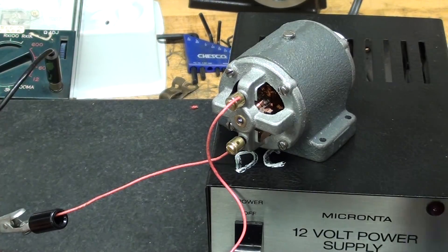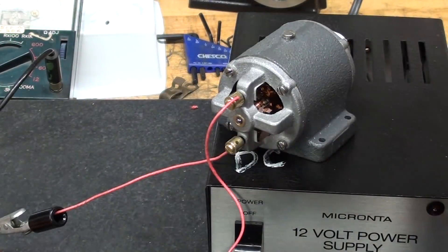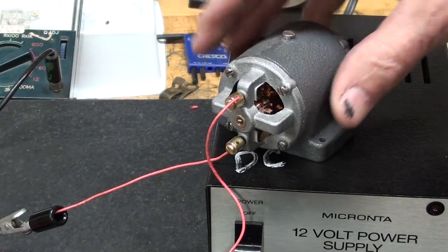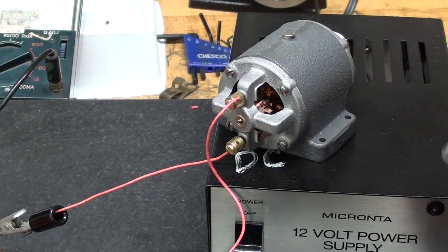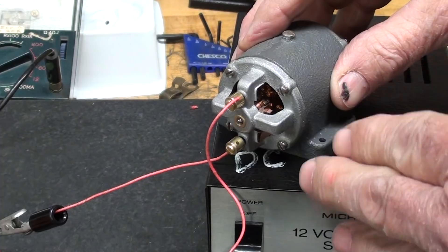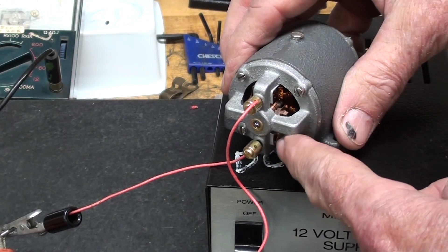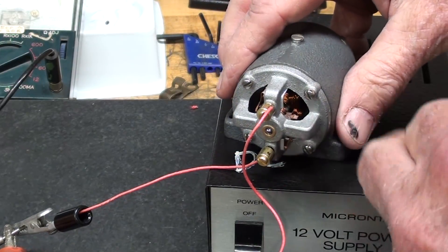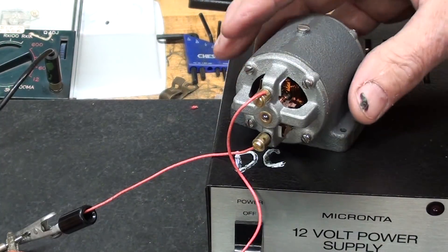Those of you that are observant may have noticed that he changed the orientation here — now the binding posts are in the vertical position. Well, I plugged the thing in, and it didn't produce much voltage, perhaps two volts. And I thought, what's wrong? And then I read through the directions again, and of all things, it said to assemble this with the brush holders in the vertical position as you see them now. I thought, well, that can't make any difference. However, there is a relationship between the magnets and the commutator and all of those things. So I changed it to this position, which is the correct position. And luckily, my screw holes were accurate enough, so I was able to rotate it 90 degrees, and it worked, fit just fine. And then I put a new index mark there, a witness mark on the bottom, and then proceeded to start my experimentation here.